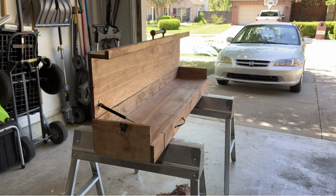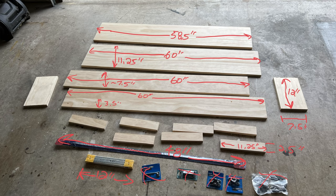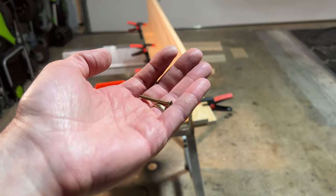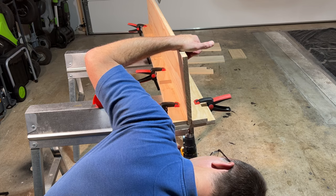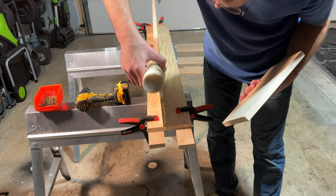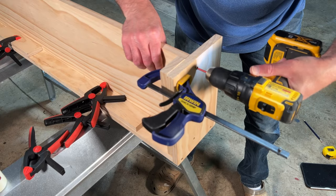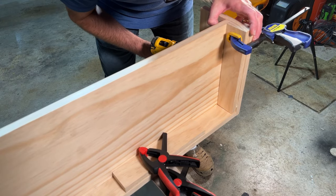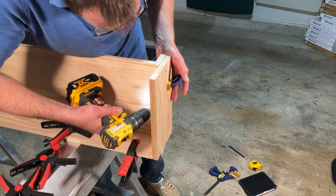The back of the layout is a piece of 1x8 inch pine, while the front is composed of two pieces of 1x4 inch pine, plus a 1x2 pine board used to fill the remaining gap and also act as a handle to lift the lid. The short 11 and a quarter inch pieces of wood used on the underside of the layout are all made from 1x3 inch pine boards. I assembled the layout case with glue and screws, favoring GRK fasteners since it is nearly impossible to strip the head on them. I clamped some 1x3 pine boards to the back of the layout to help line up where I wanted the layout base to be attached, and then the layout base board was glued and screwed to the layout back. My wood was warped in various directions, so this extra board also helped to securely attach the main layout base and keep it straight.